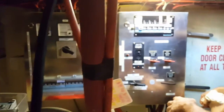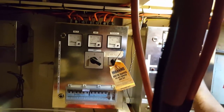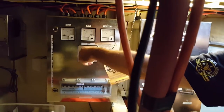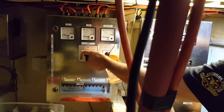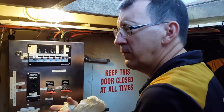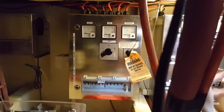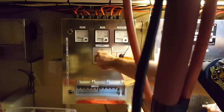When you go to ship power, it's this button here. If you're going from shore power to ship power — which means you're using the gen set to create 240 volt — you do it in two steps. You don't go quickly across; you simply go to the off position first, then once the gen set is started and running for a minute or two so it's warmed up and generating capacity, you move it to ship power. The opposite applies when you undo it: take it to the off position first, then take it back to shore power.